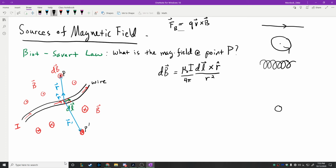What if I told you that we have a wire, but now let's say, just for simplicity's sake, that this wire is pointing with current that flows into the board, okay? So I've got a current that flows this way. Take your thumb, point it into the board, okay? And then swing your fingers around in a circle. What direction would they go? Clockwise or counterclockwise? If you put your thumb in the board in the direction of the current, so again, we're imagining a long wire comes out from behind you into the board, clockwise, right?